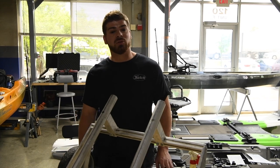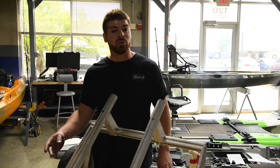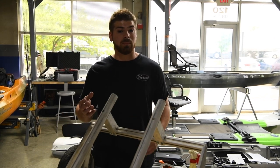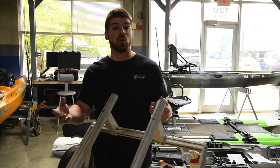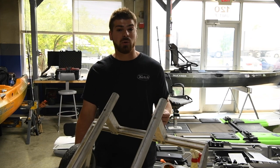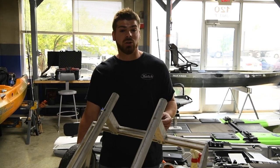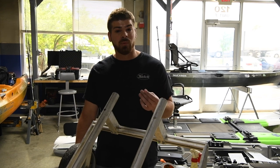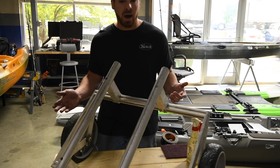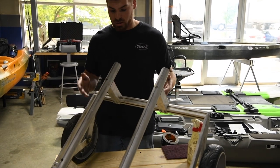The raw finish is offered so customers can get their products conveniently and quick, but it also gives you the option of taking the product out and getting it powder coated or anodized with your own color. Over time it oxidizes though when it's raw finish, especially if you leave your boat outside or if you fish saltwater conditions — it'll give you a little white film. Right now on this cart, this is a prototype cart that has about 300 miles on it and it's been heavily used, and the oxidation here is clear.